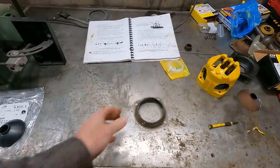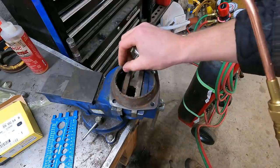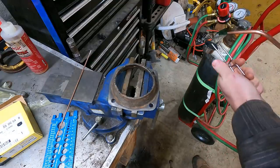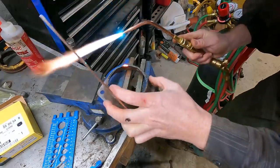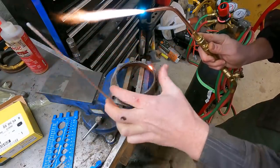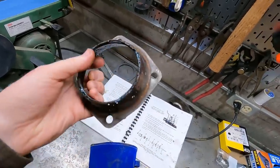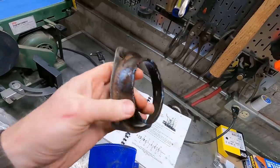The smallest tip I've got is a number 4 which is probably too big — I probably want a number 2 or a 0 — but I'll be really gentle with the heat. Just in case I need it I've got some RG45 wire I can feed in there if I start burning holes. I've tacked it in 4 places and fused the wire right there. It's not pretty, but it's been 20 years. I'm just going to grind it down now, remove all the sharp edges — I don't want it cutting the boot — and we'll call this repair done.